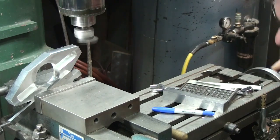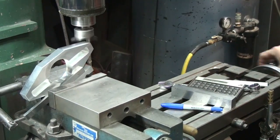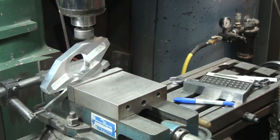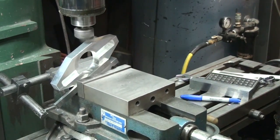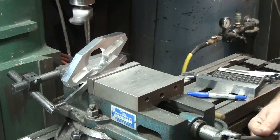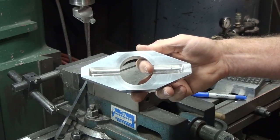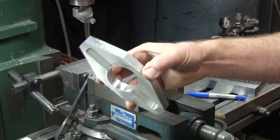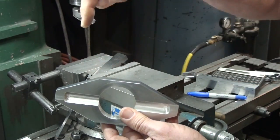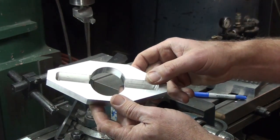This part's sticking out a ways, so you have to be a little bit careful and not take too heavy of a cut. This is a really good way to get a nice, precise angle. Overkill for this project, but I thought it might be fun just to show you another way to mill an angle. So that takes care of all these sides. In the next video, I'll do all the holes. Now that we have these angled surfaces, we can tell how deep to spot face those two set screw holes. So I'll see you then.